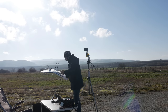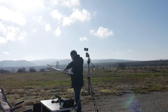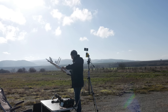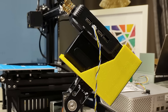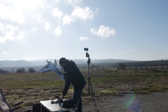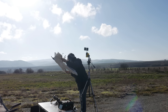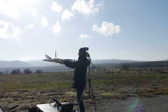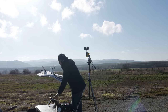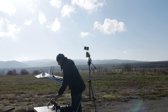The idea is that for as long as there is any video signal between the ground and air units, MAVLink data for the tracker will be flowing and it will be actively tracking. It wasn't anything complicated — TX and ground from the ground module go to RX and ground from the tracker. The rest is just a 3D printed mount for the ground unit with its own battery. I didn't have to worry about powering it while on the tracker, and that battery lasts a long time. I've done three flights since, around 40 minutes each, haven't recharged it, and it's still showing above seven volts for the 2S lithium-ion battery — so at least two to three hours of continuous operation are possible.